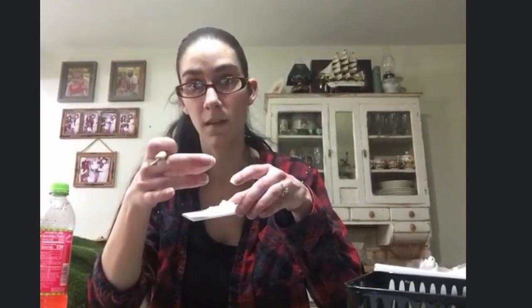That bottom piece, that bottom mane, the wing part, I would recommend making that a little bit thicker, because when you go to demold this, you want to have it as thick as possible so it doesn't crack as you're pulling it out of the mold.